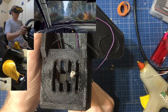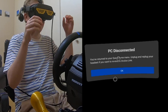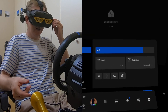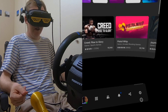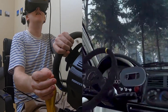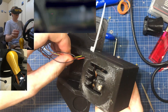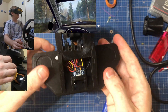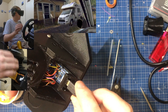It's three plus two switches — five total — and you need to solder all of them to your Arduino Micro. Oh no, I think he was going so fast that the USB got disconnected. You have to do this stupid Tom Cruise thing with your hands to get the USB connection reconnected. Add some strain relief with some cable ties and mount the Arduino here. And program it with your USB cable.